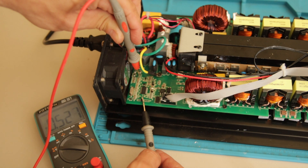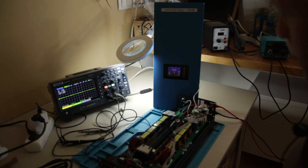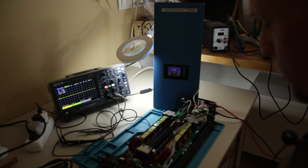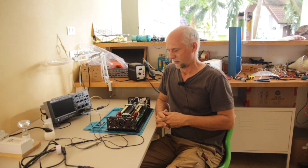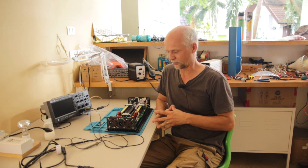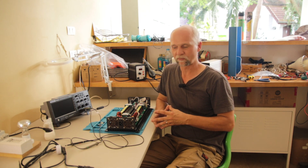So it looks like restarting this inverter will probably not be successful. The problem is the so-called grid error — the control circuit MCU sees problems with the grid input and so it does not synchronize the inverter to the grid. No bank, no success. You see how you turn in circles when you try to fix these Sun GTL inverters. With every short on the AC circuitry and the IGBTs, the chances of fixing these devices just keeps getting lower and lower.